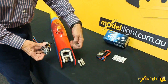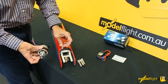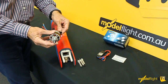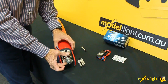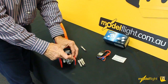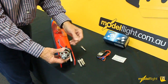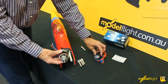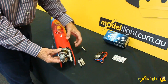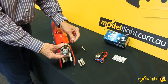These can be very simply mounted on the 4 bolt holes that exist from the radial mount. They'll be bolted on here. You'll have 4 of those, and they simply pick up on the back of the cross mount that's on the back of the Dualsky motor. So we end up with the motor strategically placed here, picked up on the cross mount at the back, and it'll be a suitable distance forward so the propeller clears the front of the fuselage. And it is really that simple. The wires that are going to run back to the included 80 amp speed control can go through the hole here that was there for the fuel lines, and the speed control will be mounted internally, and we'll flick the fuselage over and have a look at speedy and battery mounting.